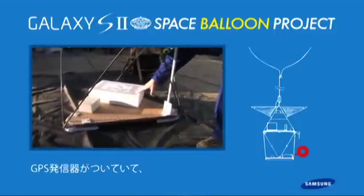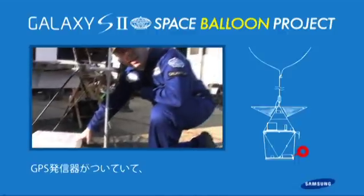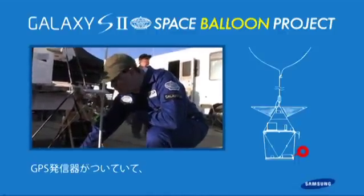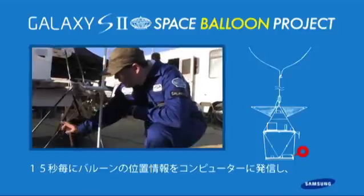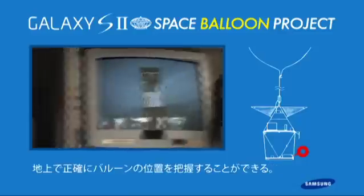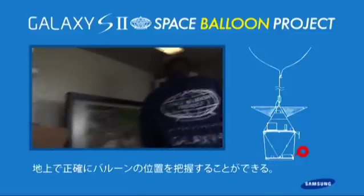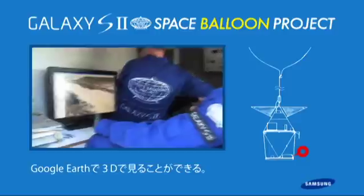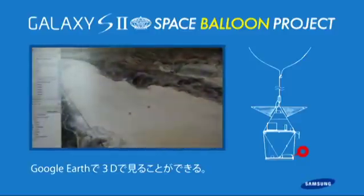We have what's called our tiny track system. Inside here is a GPS unit connected to a small microcontroller that transmits through a 2-meter radio every 15 seconds, transmitting the vehicle's GPS coordinates. We then feed this into a computer that translates the data in real-time on a 3D map of Google Earth.